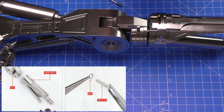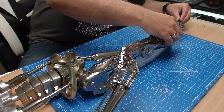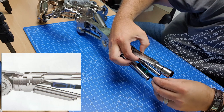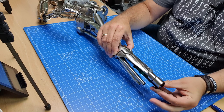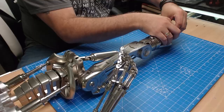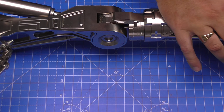We're going to be securing this from the inside — it's going to be a bit tricky to get to. We'll need a longer screwdriver and the smaller thicker screws. This time we do have to put a split washer over the top, so I'm putting that on now and loading up my screwdriver. This is probably the trickiest bit. I'm not too worried about orientation while I start screwing it in, but as I tighten it up I'll make sure it's centered exactly where I want it. It's quite difficult doing this left-handed when I'm not left-handed — it's a long screw so it's got some way to go. When you start to feel resistance, tighten it up completely.